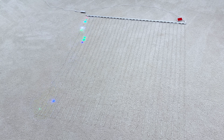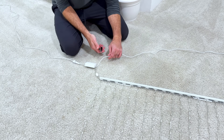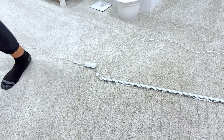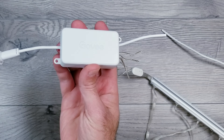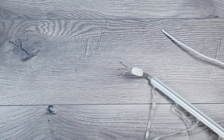There was horrible flickering that never went away. I tried changing every possible setting within the WLED program and nothing fixed it. My first thought was that there must be some type of interference coming from the white box, so I cut the cord to sever that connection — but it was still doing the exact same thing. Next I thought maybe getting rid of that 24-to-5-volt converter and hooking everything up to a 5-volt supply instead might work.